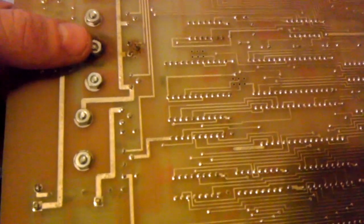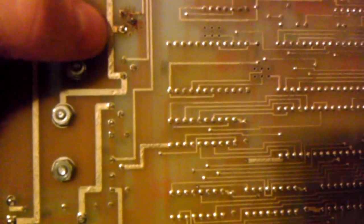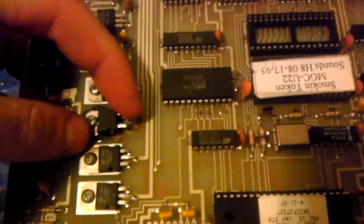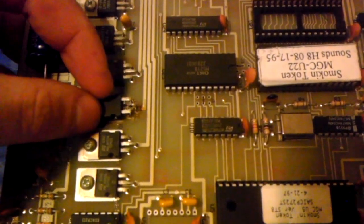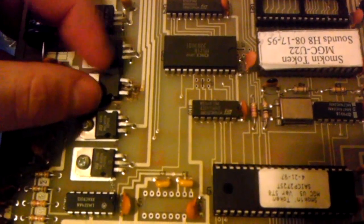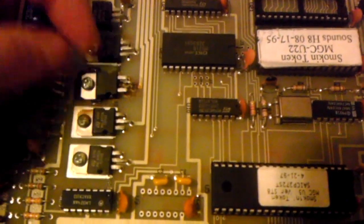From the back side, you can see the board is pretty generic. The main things you want to look for here is that the traces are intact, so you don't have to rebuild any traces. If you do, it's not the end of the world, but you need to check and plan for it in your repair. In this case, it's completely burned through on all three. I'm thinking probably some sort of mechanical damage when they were removing it from the machine, as well as being overloaded from the scorching.